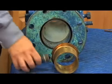I know at the swap meets a lot of people have the small little dental picks, or you could get a small little pen screwdriver, something in there to clean out those little holes. What was advisable was to take the old nipple off like this and clean it out, remove the brass, put it back in. Once you had it back in, go to your number 1 test cock, bring the water from your number 1 test cock and push it into this fitting. Now, with the water shooting in here, you could see which of the holes were open and which weren't. And again, the small dental picks were very good for getting in here that you can pick up at the swap meets to get in and clean out those little holes.